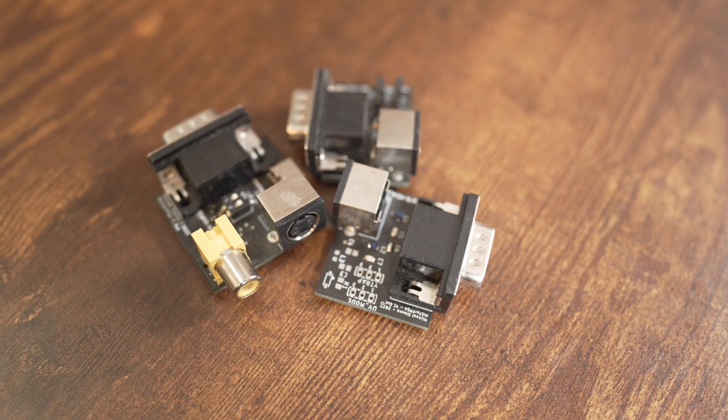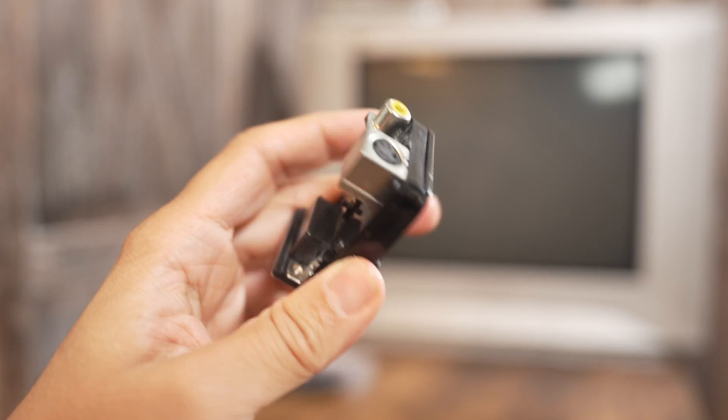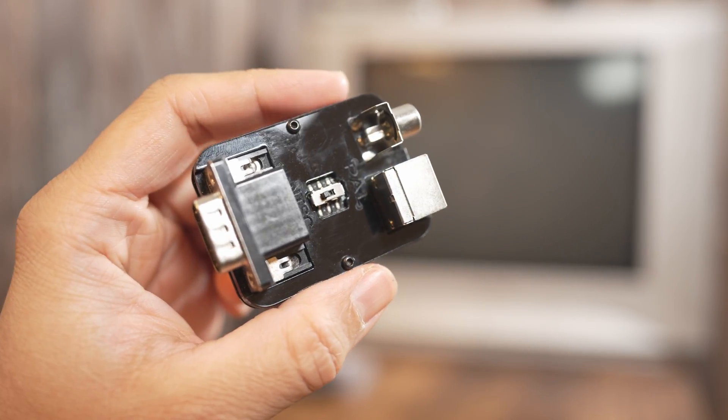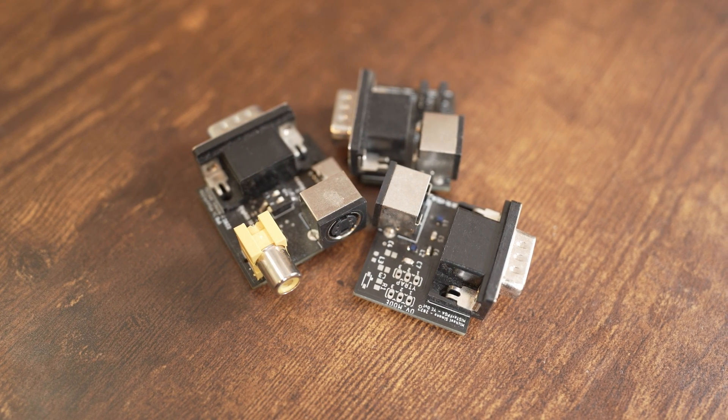So what if you don't have a television with RGB or component, or if you prefer composite over those connections? Composite and S-Video are supported via Mike Simone's active YC design. However, if you have a transcoder that converts RGB to component or S-Video, you can accomplish the same thing but with worse composite quality — you'll get severe dot crawl around the edges of graphics. Using that transcoder with S-Video would resolve the issue, but with Mike Simone's adapter design it will eliminate these artifacts from composite and give you great S-Video output.